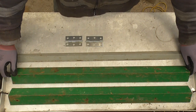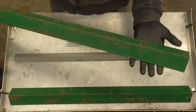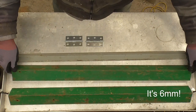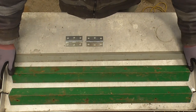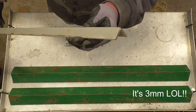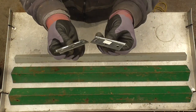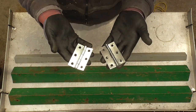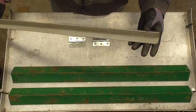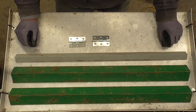The basic parts I'm going to use to construct the metal folder are recycled steel as usual. I've got two lengths of 2-inch angle, about 4mm thick - pretty decent chunky stuff - that's an old fence corner post I'm reusing. I've also got a length of 1-inch angle that's about 2mm thick, so again pretty rigid stuff, and two hinges - just standard internal door hinges. The width of my sheet bender was basically determined by this length of steel, the longest piece I could find, neatly cut down to 75cm or 750mm.